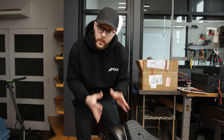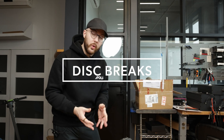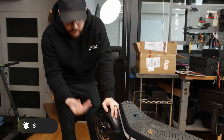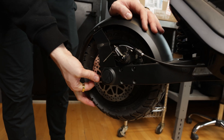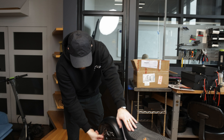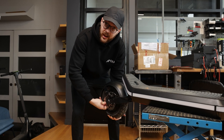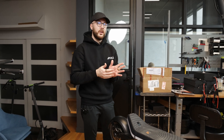The first thing you can notice right off the bat is this one has a disc brake at the back. A lot of you have been requesting it and preferring it over the drum brake, so we decided to finally put this brake on this bad boy. You can see the discs are really thick — 2.3 millimeters, versus 1.7 millimeters on a typical scooter. If you try to shake it left to right, it's not budging at all. It's rock-solid, so if you hit a curb or even during shipping, it's never going to get bent.